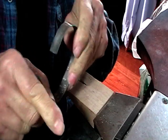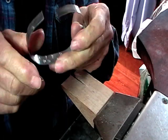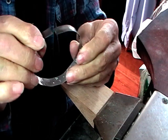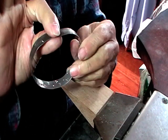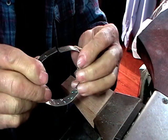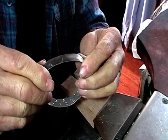The fact that you anneal this before you stamped it means it'll be easy to manipulate. Just manipulate it until these ends hold themselves together and they're perfectly lined up, and then we'll solder that using hard solder.